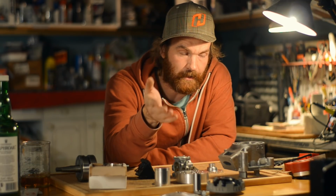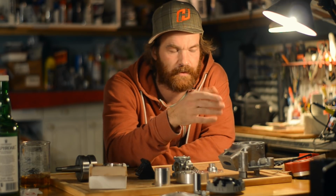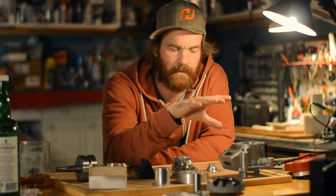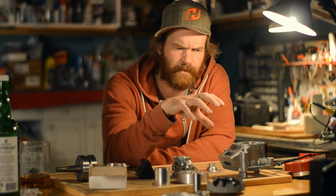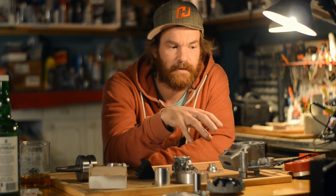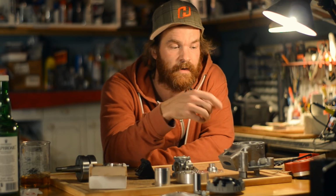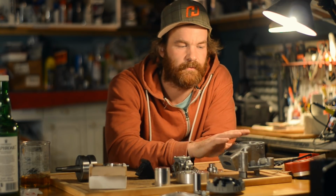If you don't do it that way, if you just spray at whatever duty cycle, the problem is you will get some cycles rich, some cycles lean, because fuel won't be properly mixed in the crankcase. As there's a lot more mixture in the crankcase than what's used in one cycle, you can get a couple of cycles with a pocket of no fuel at all, and then maybe a couple of cycles with a lot of fuel, and then maybe one with the right mixture, and the engine will just not run properly at all.